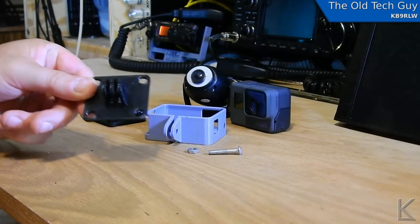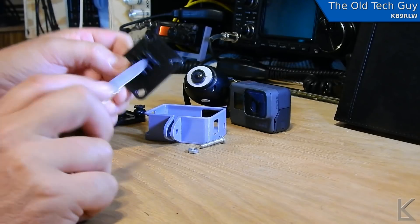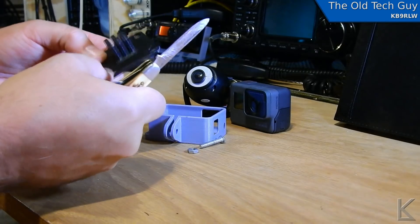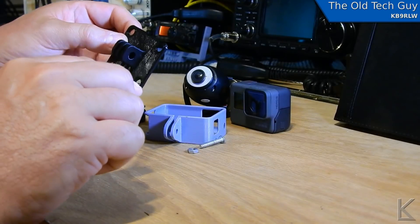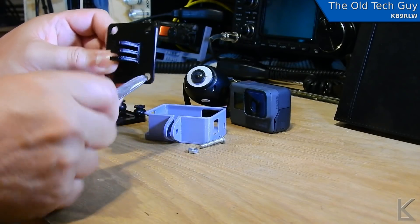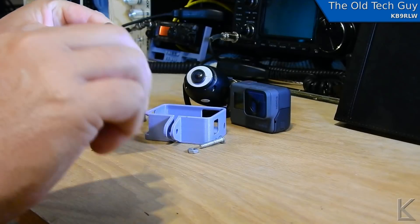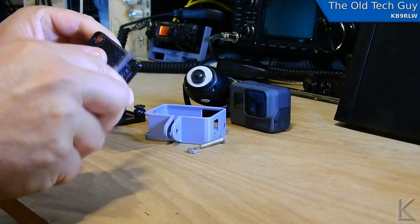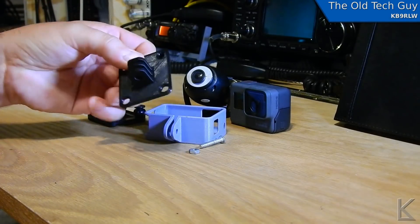Here is the finished piece. I was just taking my pocket knife here and gently going around the inside edges to remove any burrs, because I don't want this to cut or start a cut in the neoprene shock mounts. I want it to be nice and smooth so I don't damage those mounts. There's a burr right there, so I'm just sort of shaving that down a little bit — not using much pressure. I just want that to be smooth.